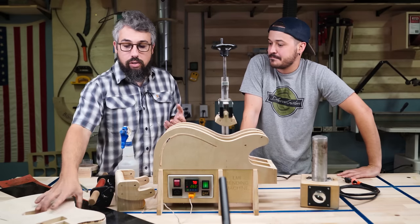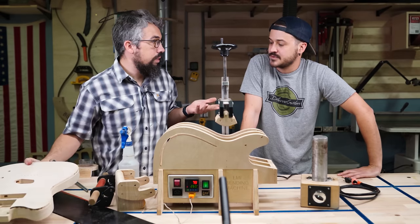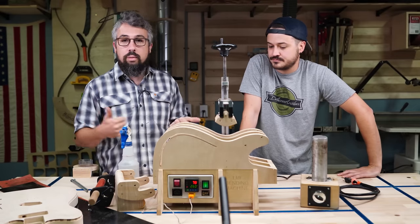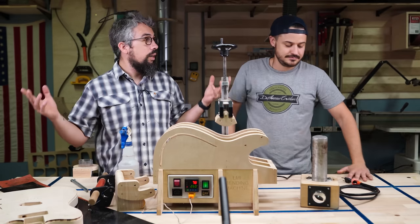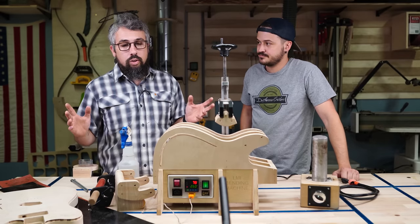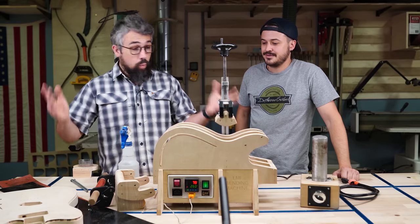So what we'd like to do is wooden binding on our guitars. Because the electric guitar has such a hard cutaway, we've had to use non-figured wood. That's the first piece of advice I'd give: if you're new to bending wooden binding for either an acoustic or electric, find a wood that's not figured. As much as you want to use beautiful figured koa or maple, you can do it, but it's gonna be really difficult. Be prepared to break a lot of pieces.